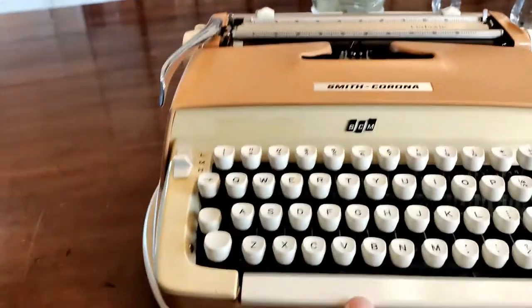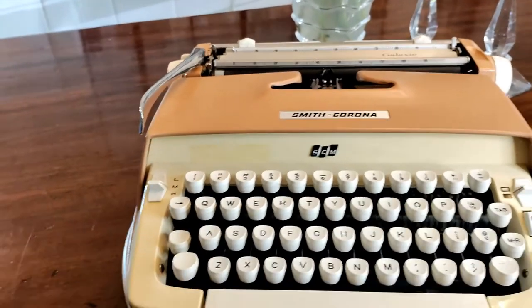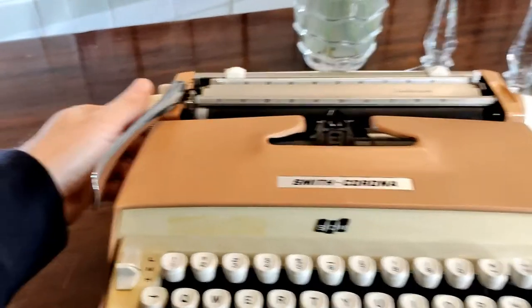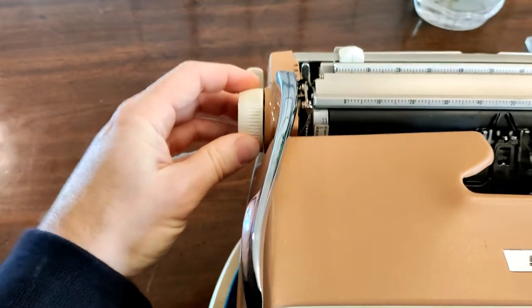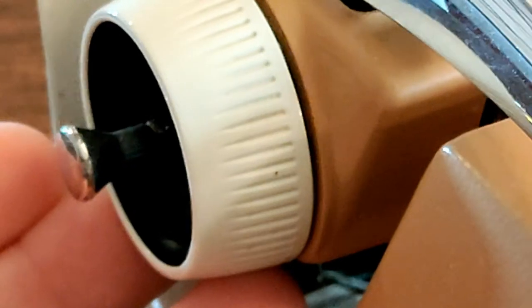Because now look — oh my gosh, my typewriter is broken! It's completely disengaged. You need to move the carriage to engage it so you can then type. Sometimes that tricks up people when they get their brand new typewriters. On the left we have our page gauge, which can be set — I'll zoom in a little — to help you count down the amount of paper you have remaining. Just to the left of that, you have your click release lever, which is essentially the same function as pulling the knob out to freewheel the platen.